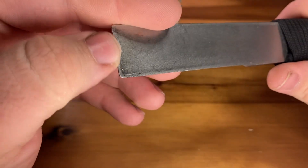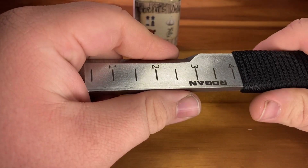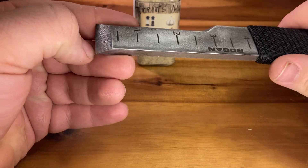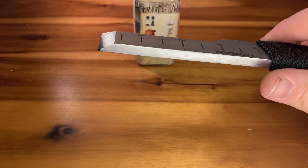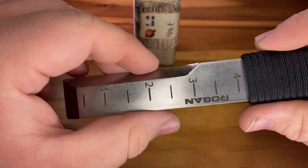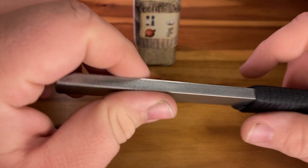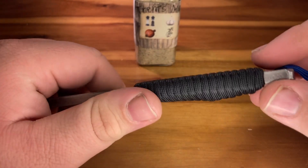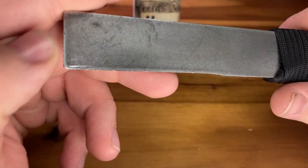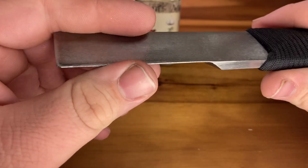I don't know if that hardness rating of 51 to 52 is consistent throughout all the tools, but that means this will be prone slightly to dinging, scratching, and dents. At the same time, it might be better for the steel considering this is a pry tool — it shouldn't snap on you. It's more likely to want to bend, which means it's simply less brittle. While the edge will take dings, this is less likely to break in general, so I think that was done intentionally. The overall finish is slightly off, but considering these are basically all still handmade, that's not unexpected. Some of the deflections are my own doing from carrying it for about a week.